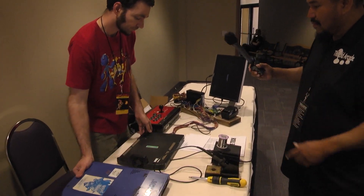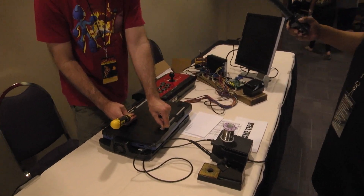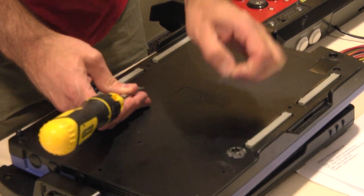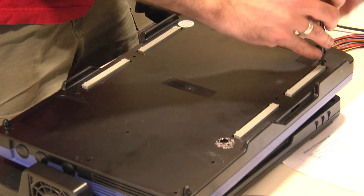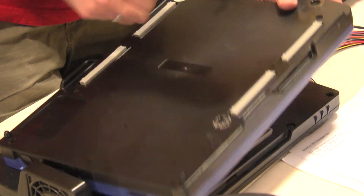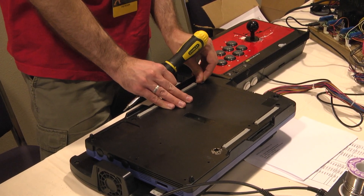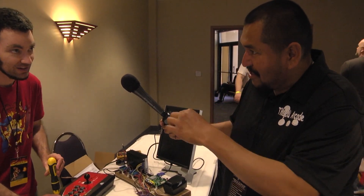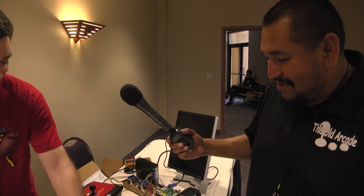So pop this guy open. Wow, we got some original Capcom stickers on here, and this thing has never been opened. That's scary. Hopefully we don't find acid damage. It's like a lottery ticket — sometimes you win. Sometimes the acid damage is so bad you'll actually see corrosion on the back corner screws, or sometimes discoloration on the case where it started to leak into that seam there. But externally this looks pretty good, so hopefully we're clean. I recently changed the battery on one of them — it was Dungeons and Dragons. It was starting to corrode — you could see the corrosion coming out of the battery but it was still giving voltage. So I'm glad I got there on time. Who knows how much time you had left.